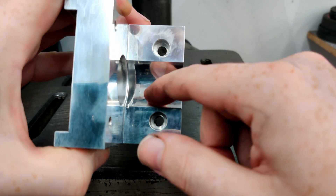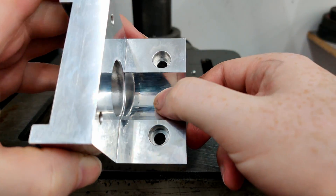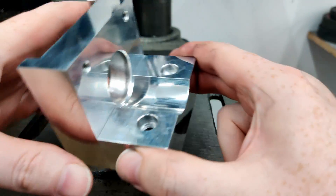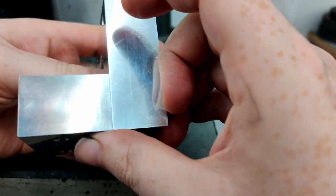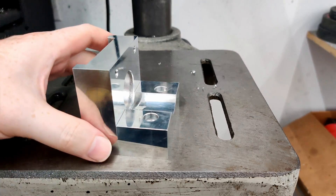When I was roughing out this pocket, the machine was set to 200% feed and 50% on the spindle because I was doing some testing and it was still set that way. That would have been a catastrophe. The end mill survived though — the flutes were fine. I'm not sure what kind of chip load that was, but it was a lot.